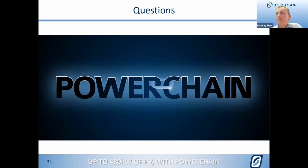Yeah, so just to follow up there, so the 5 managed AC coupled inverters in a power chain configuration, that's per manager. So on a single phase system, you're quite right, there would only be able to have 5. But if you're on a multiple phase system, you can have 5 per manager. So in a 3-phase configuration, you could actually have 15 managed AC coupled inverters in the power chain configuration.